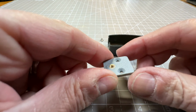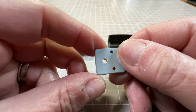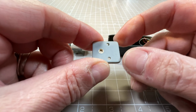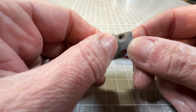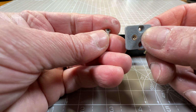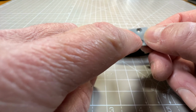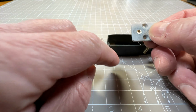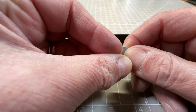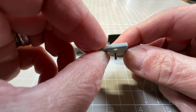All right, there you go. It's in. I think it's okay. So I'm just going to, might not be able to do this quite so easily on camera. I'm just going to mount the cartridge to this using some, I think these are 3mm. So I'm using 3mm to mount that. I think it's Imperial originally. I'm using 3mm thread insert though, and then 2.5mm screws through to mount the cartridge. So I'll do that off camera and bring you back when it's fitted.